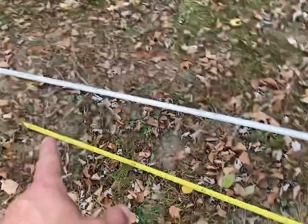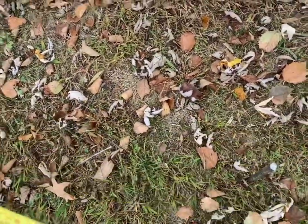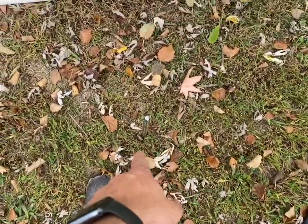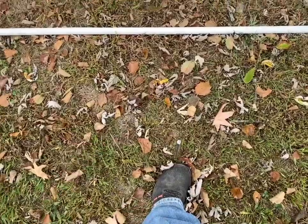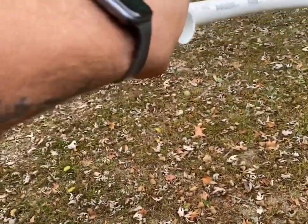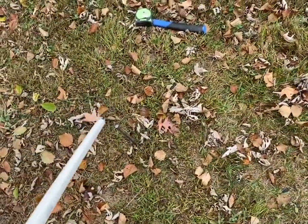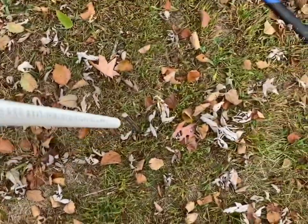We've got our rebar laid out 12 feet apart, so we can take a measuring tape back. One thing I'll add is this was just for testing, and this piece of rebar isn't completely straight. Whenever we do it on the actual greenhouse, you want that to be as straight up and down as possible. We don't want to put a bunch of extra stress on the PVC that we don't have to. We're slipping this right over the top of that piece of rebar, and that's holding it up nicely. Make sure that it's tilted in. It doesn't really matter for this demonstration, but I want you to get the idea that that T-section has to be facing towards the inside, and then this one in.